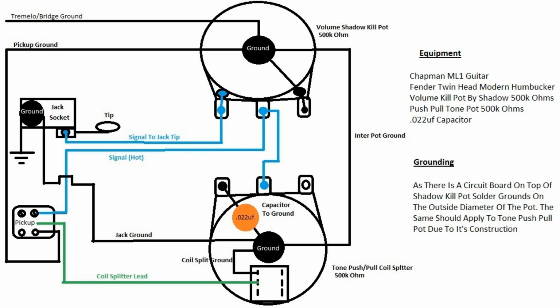When you turn your tone pot down to number 1, you will find that the resistance between the centre and the left-hand terminal on the tone pot is very low. So more of the signal will get passed down through the capacitor to ground, and hence it will filter out more of the high frequencies, or more of the treble. And that's why it sounds a lot bassier when you turn down to number 1. So that's enough of the theory.